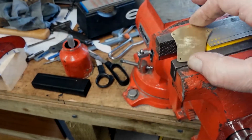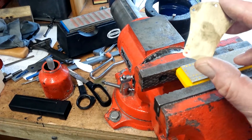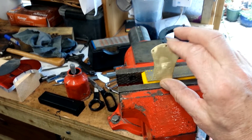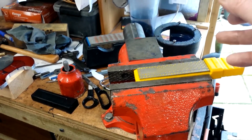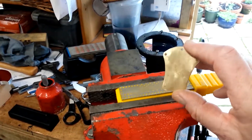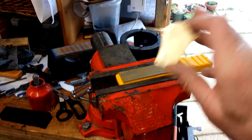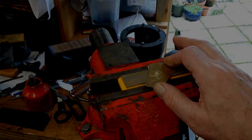It's not going too badly. I've been at it for five or ten minutes and it's starting to clean up. Some of the scratches are already out of it. Some are still present, but what we're getting instead of a scratched plate is more of a finely abraded surface. I'm using the coarse side of the diamond lap, so that's going to leave a dull, sanded-looking finish. Once the scratches are polished out and the whole thing looks finely abraded, I'll turn it over and use the fine side, and hopefully that will bring it up to a reasonable shine. That's the plan anyway.